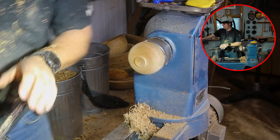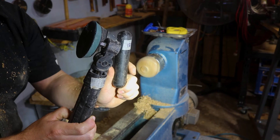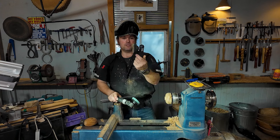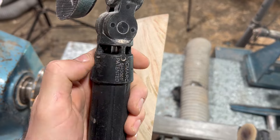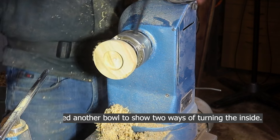If I'm getting track marks like railway lines around the bowl, the reason I use rotary sanders is because they leave a lot cleaner finish than the powerhead sanders. This one here is by Ubeaut Polishes - they don't make them anymore unfortunately - but Vicmark tools still make theirs. These are really cool because you can also put a vacuum connection in the back and it draws the dust in through the little vents. I've made a full video about sanding that I'll link at the end. Now I take the bowl off, turn it around, and I'll show you how I go about the inside.